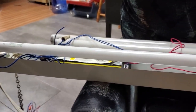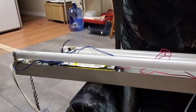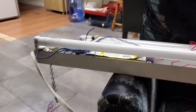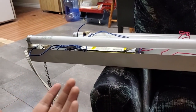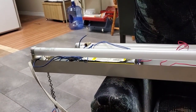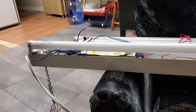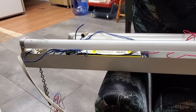Now I'm simulating a lamp with two blown cathodes - see if it starts. And it does not. A nice trait of these Motorola ballasts versus modern electronic ballasts is that the open circuit voltage is relatively low. While that means it won't start lamps unless they have apparently at least one good cathode, it'll never instant-start the lamps. A lower open circuit voltage is generally better for the lamps. There's no risk of instant starting them, although this wouldn't do it anyway because of that delay before it applies the high voltage. This is a very gentle ballast - lamps probably last longer on it than with a modern electronic ballast.